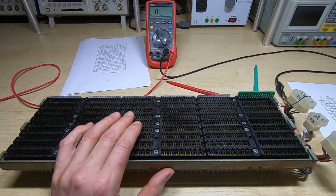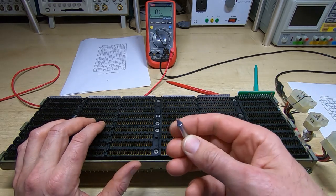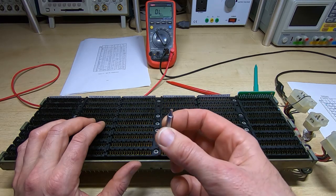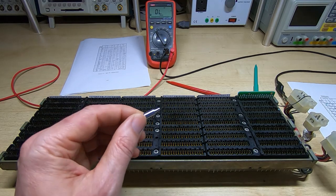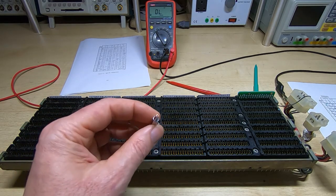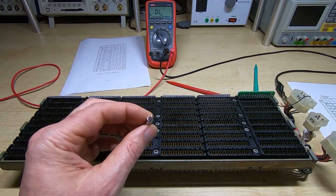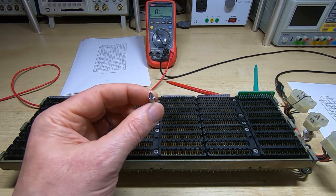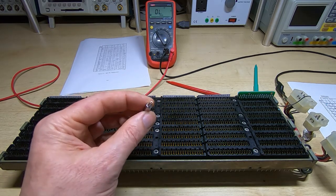If you imagine there's a perforated sheet sitting between the wires and the PCB — the holes in it are quite big so you can just about get through it, but not with a soldering iron. And if you get a soldering iron that's fine enough to go in there, it won't have the heat to heat the pin up to solder it properly. So instead, I've got a number of bits that I use — I do quite a few of these so over time I've developed a method. This is not for my standard soldering iron because those use very specific bits where the heater element and sensors are inside the actual tip itself. This is just a cheap standard type soldering iron.